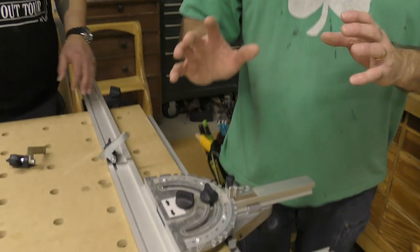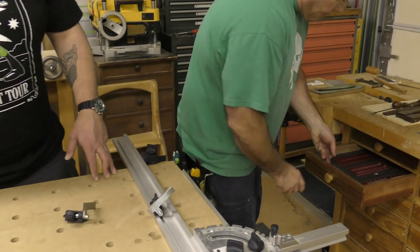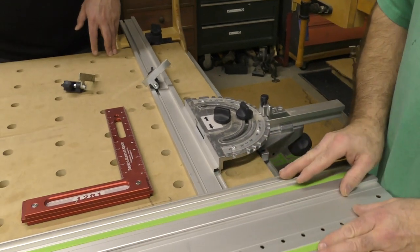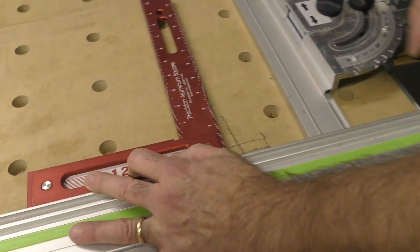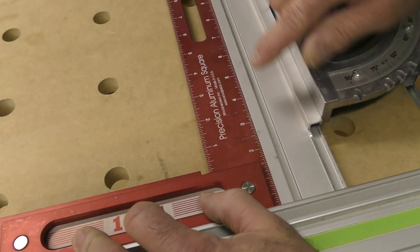But now, we want to make sure that we're going to get a 90 degree cut. So what I always suggest with everybody is make sure you have a really accurate square, okay? Now, all aluminum extrusion from any extruder is extruded perfectly parallel, okay? So if this is extruded perfectly parallel and this is perfectly parallel, we need to know that this intersection here is at 90. So when we put our tracks on here, we'll get that 90 degree cut. Okay. So I always find a square that has a tall leg or tongue, and I bring it in here just like this. Okay, see that?